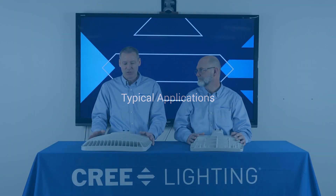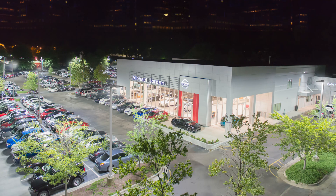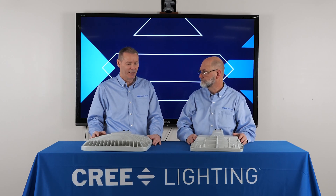Let's talk about the typical applications where the OSQC would be utilized. The OSQ family is a very versatile fixture. We've got many installations in retail applications, petroleum applications, and automotive dealership applications. Pretty much anywhere that you need good quality lighting in a site and area space, the OSQ is a perfect fit. For automotive dealerships, it has an optic we call our automotive frontline optic, where it delivers the light down to that front row of cars to help accentuate the retail aspect. We've also got an option we call our 50K9 — a 5,000 CCT with 90 CRI — which allows the light to draw the colors out of the cars so that customers shopping in the evening see them as if it's daytime. An outdoor showroom.